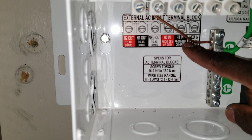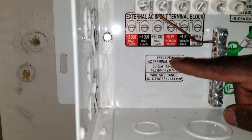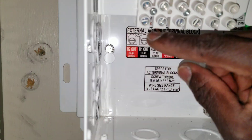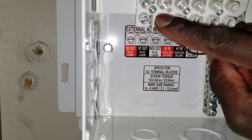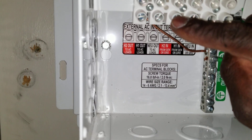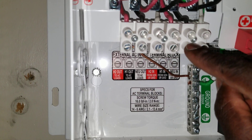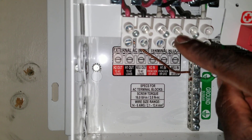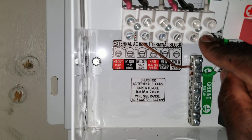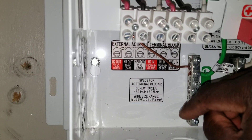The AC in 120 goes to the hot wire right here — the black one. So what we have wired right now is going to be 240. So it's 240, but I can tap one of these for 120. This and this is 240 — live, live, neutral. So it's 240 right there: black, red, black, white. This is a 240 in as well, but I can use this or this for 120 — just one leg at 120, depending what leg I want to use.